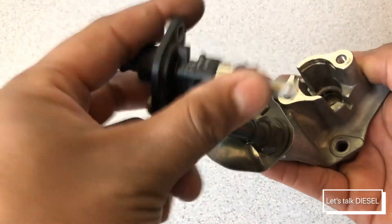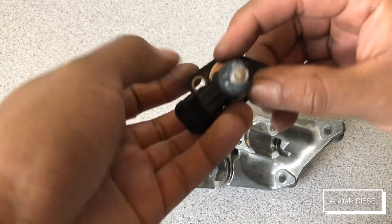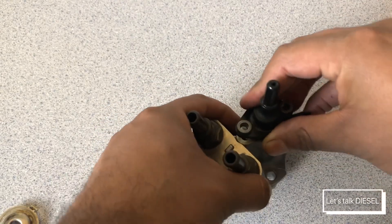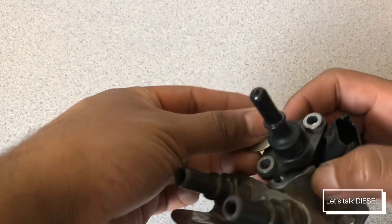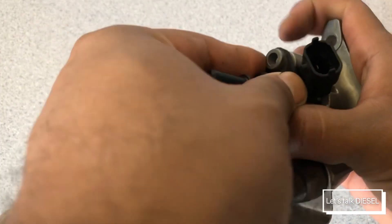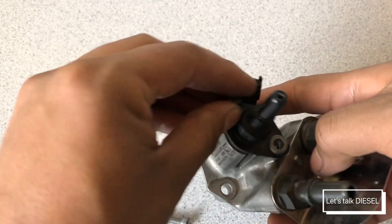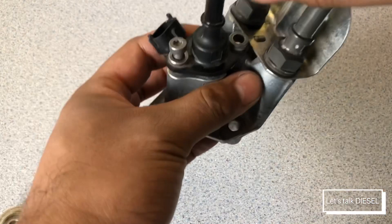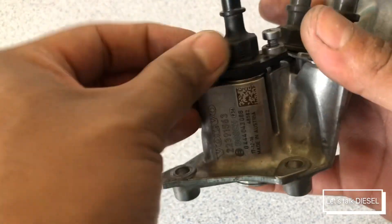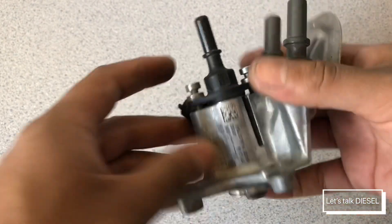For the nozzle, make sure it has the o-ring. The trickiest part is installing this o-ring because it goes like this — you see, it tends to fall off while you're trying to install it. Once you install it, you have to put a little pressure on it. This is where the bolts come in handy — just install the two bolts and put pressure while closing them, and it should close nicely. A little bit of grease will make it easier.